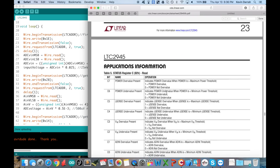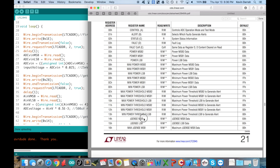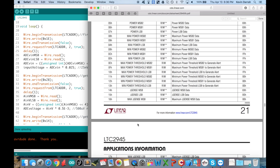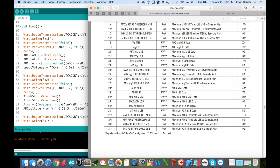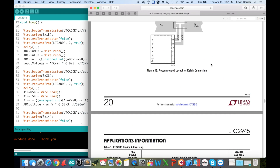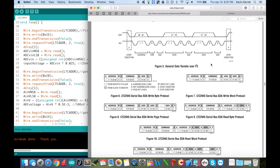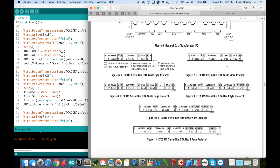For measuring current, we read the sense value which comes in as two bytes — MSB and LSB — and combine them into a 12-bit value, then convert that to a voltage and divide by the sense resistor value to get current. That's in addresses 0x14 and 0x15. VIN is at 0x1E and 0x1F. The extra analog input is at 0x28 and 0x29. The I2C protocol for this part is not as standard as some devices I've used, so I had to hook up a logic analyzer and compare it to the timing diagram until I got it working.